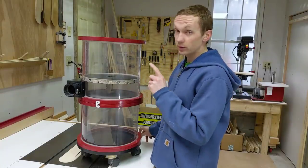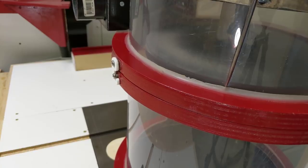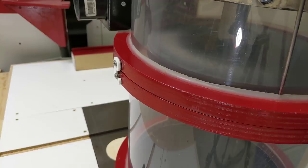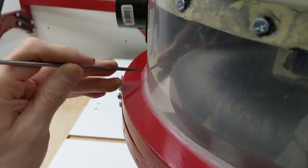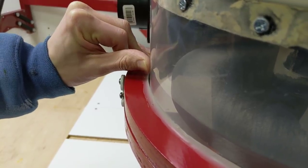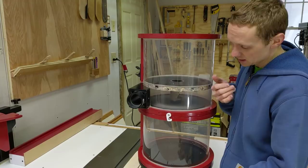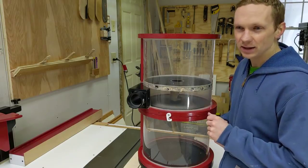Now that I've got it cleaned up, I can show you the biggest problem I have with this cyclone. I used 100% silicone sealant to seal the polycarbonate to the painted wood rings, but soon after I started using it, I noticed the sealant didn't stick very well to the polycarbonate at all. You can see when I stuck this pick behind here that I can completely run it behind the sealant — there's really no bond between the polycarbonate and the adhesive. And it howls as air whishes through those little cracks, making a terrible noise.